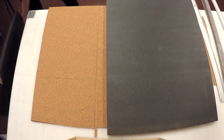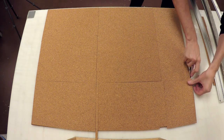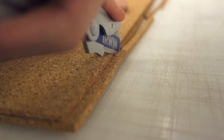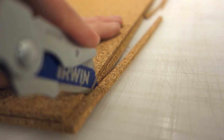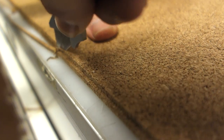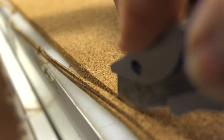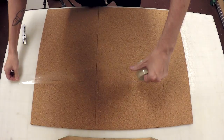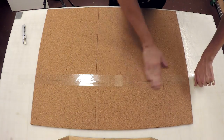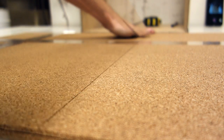When the weights come off you may find that some parts have shifted slightly and for some reason expanded. So curse to yourself quietly while you break out your carpet knife and start trimming the edges to match the size of the underlying board. To make sure nothing will separate over time, or if the glue should fail and nothing will lift, tape all the seams with wide clear packing tape to hold it down.